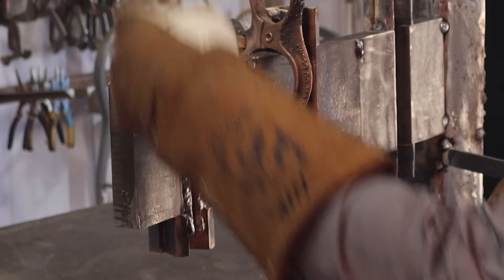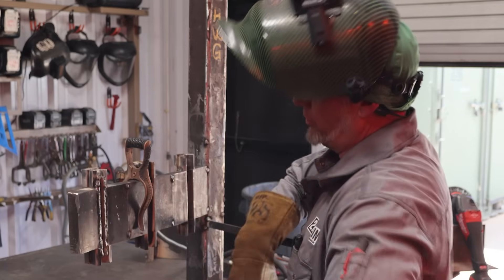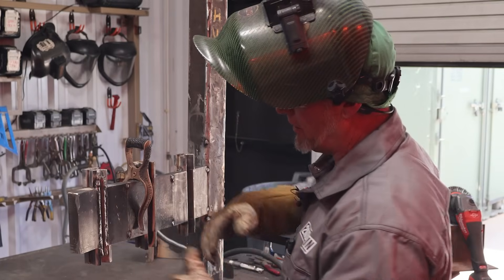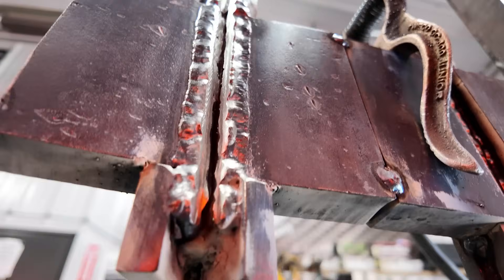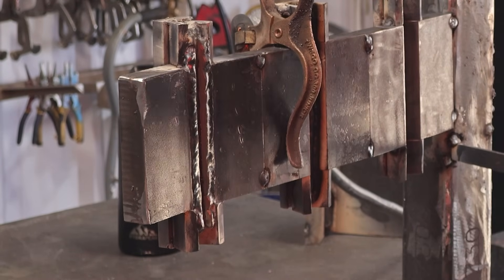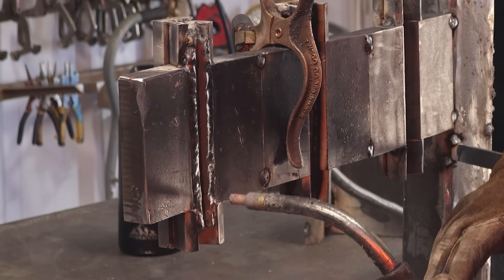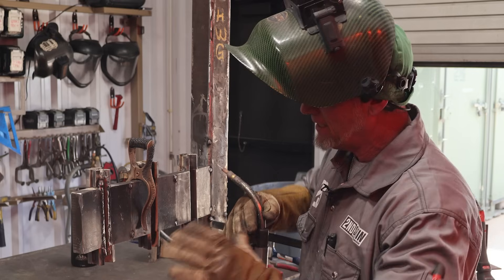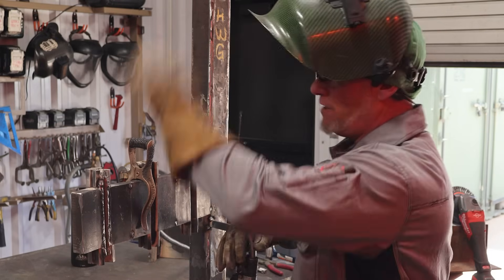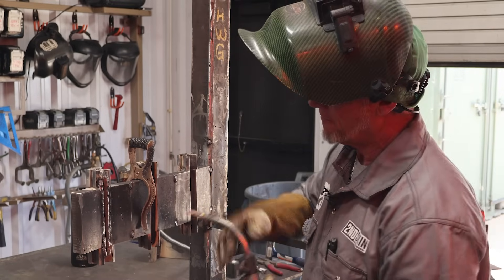What I did here is I did one side, capped off the edge, capped off this edge, and now I'm going to run another bead right down the middle. I don't go crazy with my grinder — I can't afford scratching something else, let the wheel do the work. I've opened this up and just V'd it tiny so I can throw that pass through there — it's like its own little V groove, and it'll cap that center for me. There's a good chance this is low right here, and that's okay — I've got tons of metal I can fill it with. A professional will throw this pass in, get the VWAC gauge out and check it. If that pass is low, I'm not going to do a little patch — I'll grind that down, throw the pass in again, and it'll look professional. A few seconds, no patchwork, looks amazing.